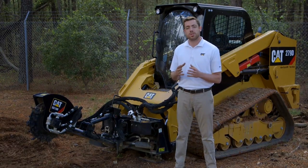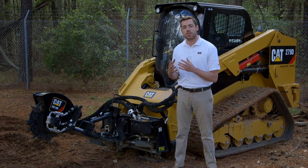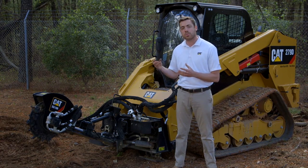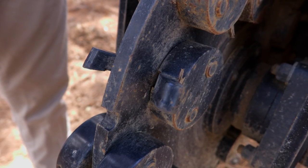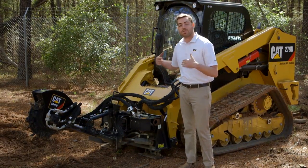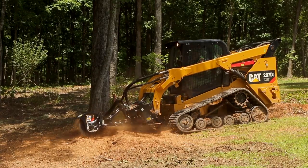The key differences between the two units are the way they control the depth of the cutter wheel. A stump grinder uses a 32-pronged cutter wheel out front with hardened, reinforced carbide bits that shred material — whether that be a hardwood, softwood, or pine, like we have here in North Carolina. On the stump grinder itself, you've got key features that allow the machine to sit on a stable surface and then control the grinding of the wheel independently.